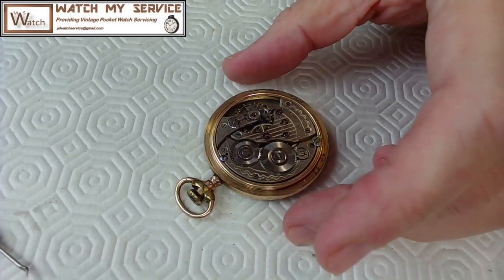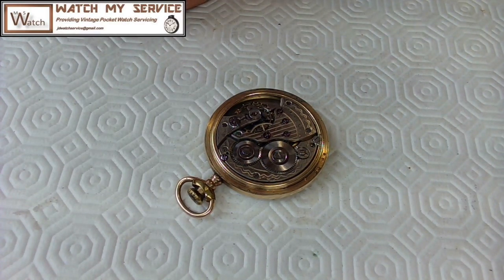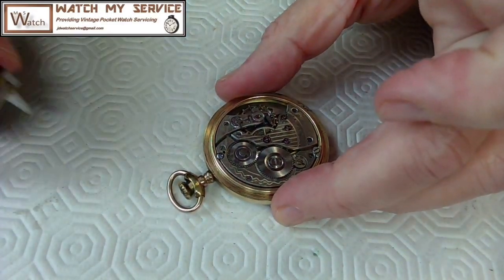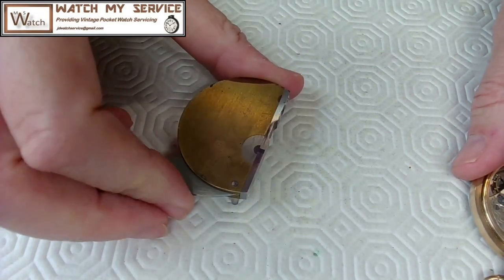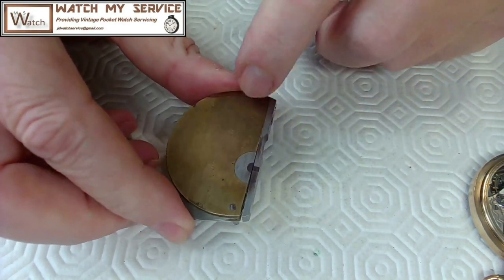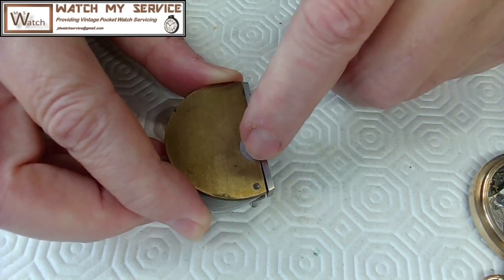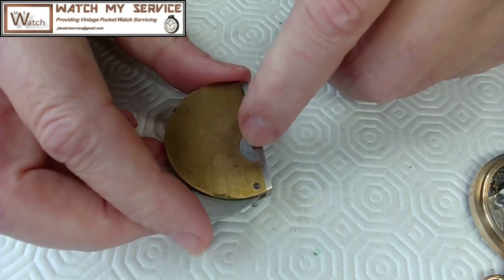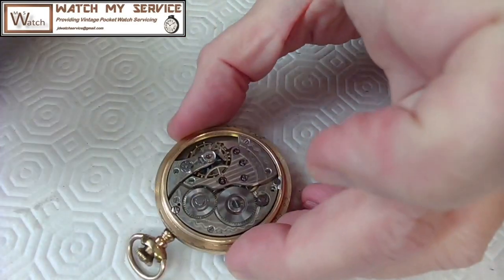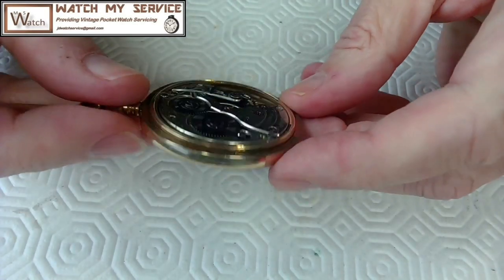This watch here — you see some tabs. I put this video up the other day and it turns out these things are pretty rare and pretty valuable. Now I've got to figure out how to make little grooves in here for the stud holder for hairspring studs. I will do that with a very small file a little later on — but that was a squirrel moment for you, just to keep things interesting.